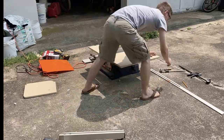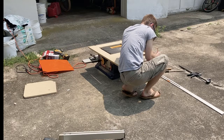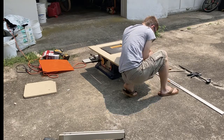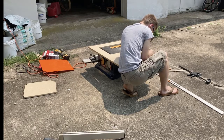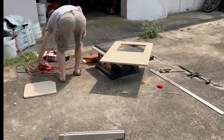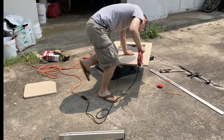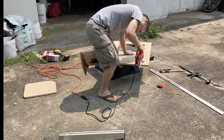Now I'm going to cut the corner piece for my dryer vent exhaust. I started out too small because I wasn't sure of my dimensions, and you'll see I had to go back and cut it again. It ended up being right around 5 by 5 inches — the dryer vent dimensions are about 4 and a half inches, but I needed a little extra for wiggle room so it wasn't too tight.